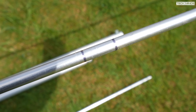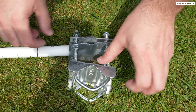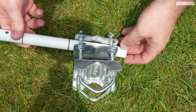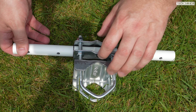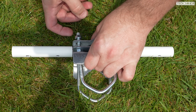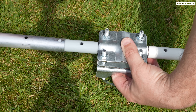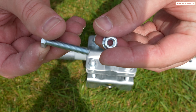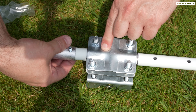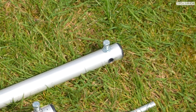There are a couple of ways to start the build, but essentially you begin by inserting the GRP rod into the included bracket, ensuring it's centered using those pre-printed lines. Obviously when assembling this way you cannot fully tighten everything up yet, as you still need to insert the bracket onto a mast. The main elements have two pre-drilled holes — slide these over the GRP rod, then insert the included bolts. The two outer bolts can be tightened, but don't tighten the inner ones just yet as we need to connect the transformer. Ensure the ends of the elements have the bolts pointing upwards.